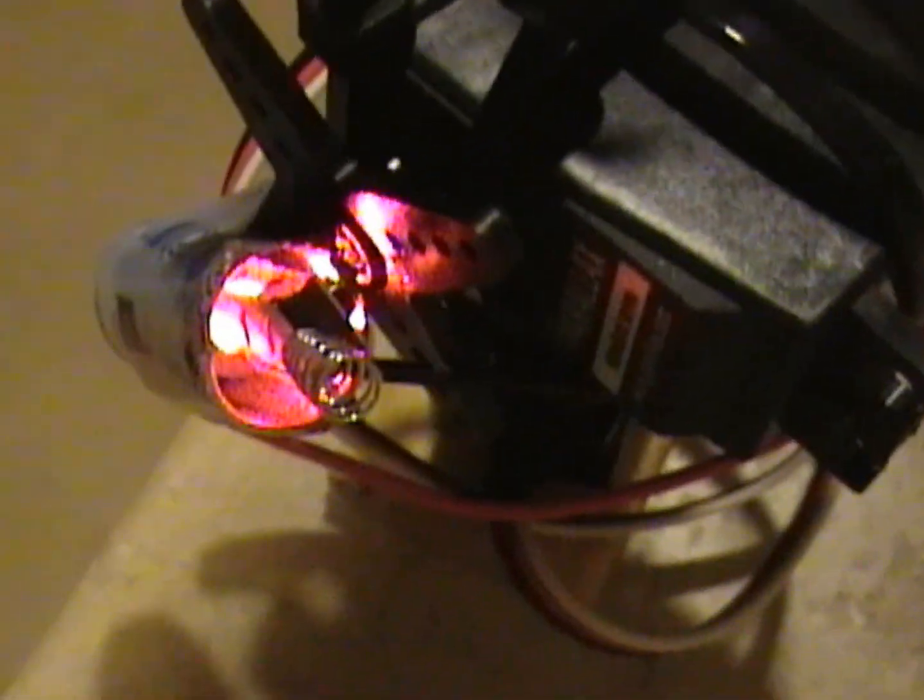So I just did some soldering. I hacked off the back of it — that's where the batteries are held. Originally the positive side would connect to the spring, and you would have to press that button. But I just skipped the button and soldered straight to the connector to the right of the button. The positive side is through the frame, so that's where the 5 volts go. I unscrewed the cap, put the positive wire in between the cap and screwed it down. So it's not actually soldered on there, it's just wedged in there. But it works.